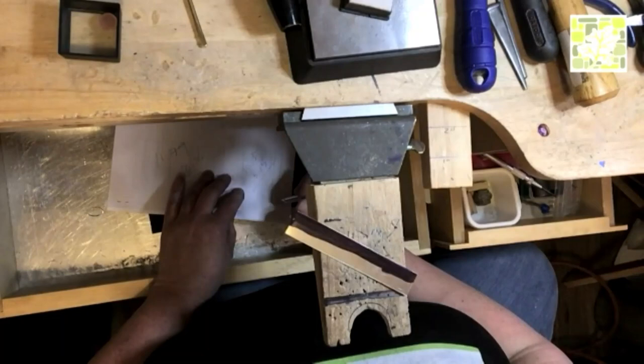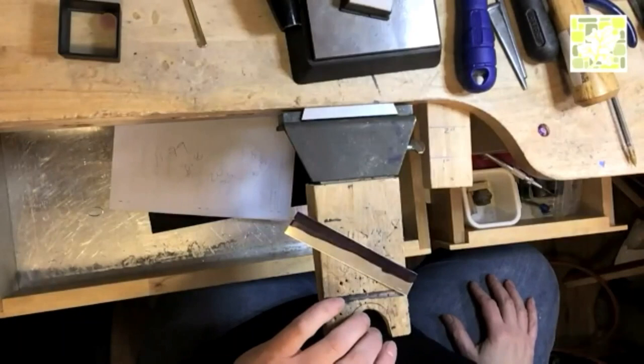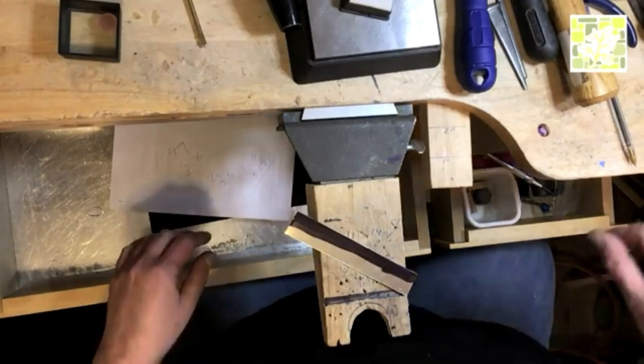Yeah, we're getting about 35. Let me just be clear. You need to account for the thickness of the metal, and by using 3.5, you're doing that. If you're using 3.14, then you need to add the thickness of the metal before you multiply it by pi. Got it. And again, this is why I like to use a piece of tape. So let me do it properly. I'll bring up my calculator.